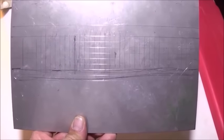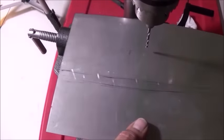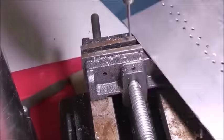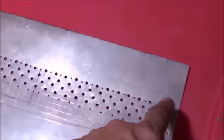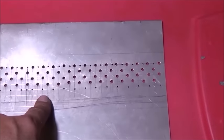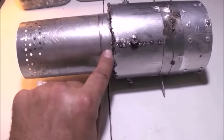What I'm doing now is finishing the afterburner section of our engine. I had to lay out a grid here with quarter inch spacings between each mark all the way across, and I'm going to drill a bunch of holes on the drill press. I've completed our drill pattern — we have 80 one-eighth inch holes and 40 one-sixteenth inch holes. I've got the afterburner rolled and welded together. We can slide it down inside of our collar, which means it's removable to get to the fuel line.